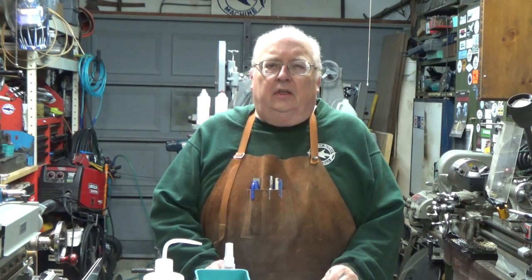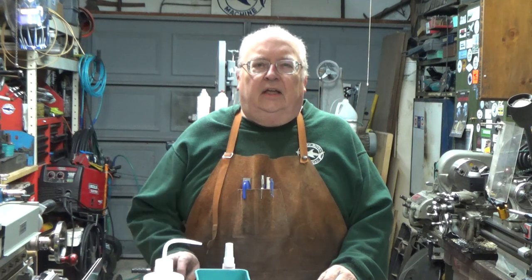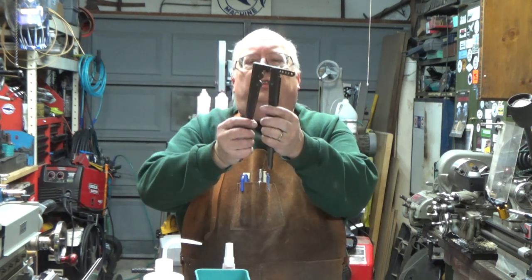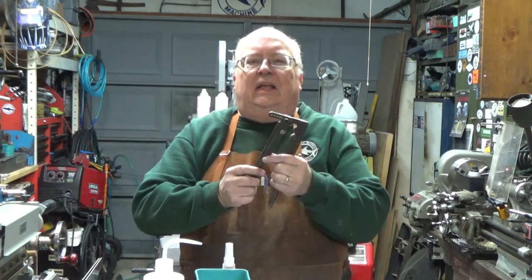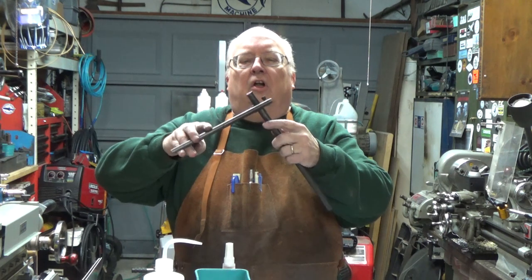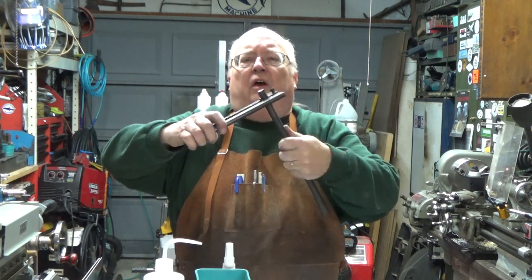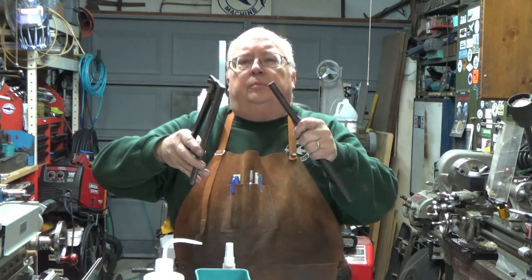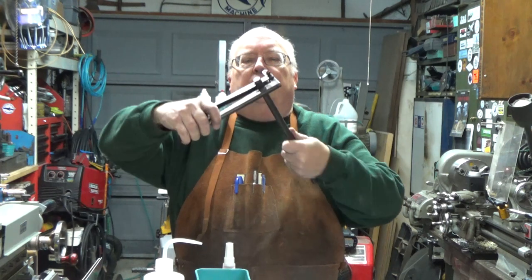But when I first aired the video, I had a lot of questions about a manual knurler, and it's something that I'm actually quite familiar with. Here's one that I have, and I used when I was in the automotive business and had my automotive machine shop. We also did electrical rebuilding. And this one was specifically made to knurl armature shafts that had the bearing had spun on. And you could take and run a knurl on it, and with a little Loctite you could press the bearing back on it and save an armature. So it's something that I was familiar with.